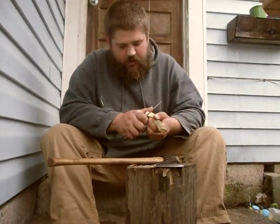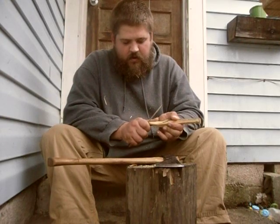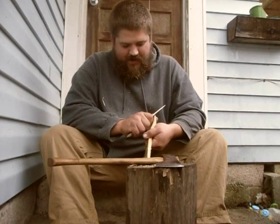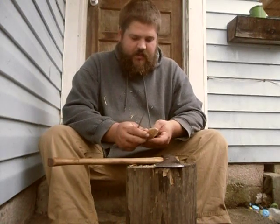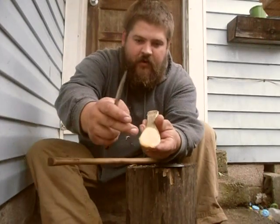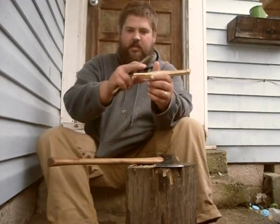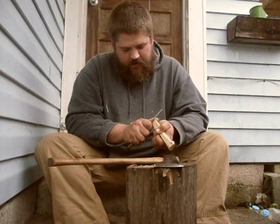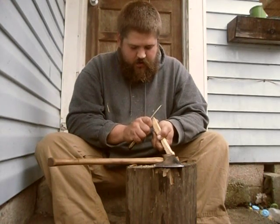What I'm going to do now is kind of rough that bowl out a little bit more. I'm going to use my knife to kind of true up the semi-circular edge - it's more like an oval, got that teardrop look to it. See, I've got the bevel all the way around here. I'll end up truing it up a little bit with a spokeshave - it helps to keep the bowl nice and flat across there. Then I'll go around and bring it up to that bevel so it's got the same amount of meat all the way around that bevel.